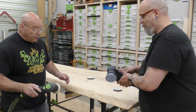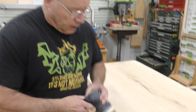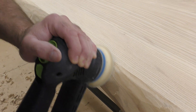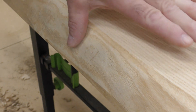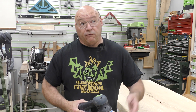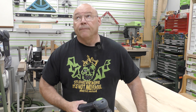Let's get going. Big D, you have 40 grit on there, right? I'm going to take the draw knife here and you'll see — took quite a big dip out. Magically that grain is appearing; we've taken those heavy cuts out. You can see it's basically a grinder with dust extraction. We'll start with 40 grit because we're going to leave it until final sanding, but we'll take all the heavies out and then go with our RO and interface pads.